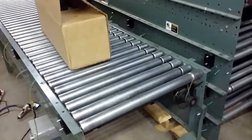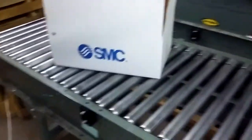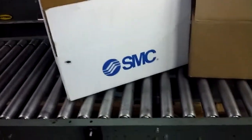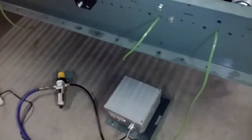So it goes again and stops — that's what we want. If other boxes get thrown on here, they'll just keep creeping up. If too many boxes put too much pressure on this and two and a half feet isn't enough zone, you can wire in a T-fitting into these two lines — it'll just be a smaller size for the right hose. That's it!